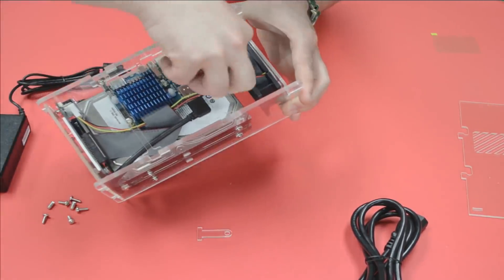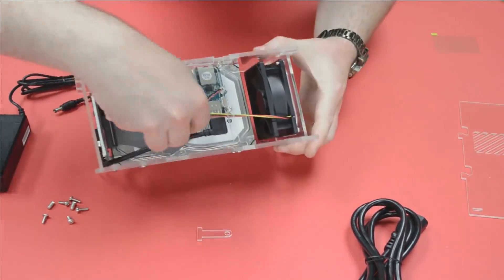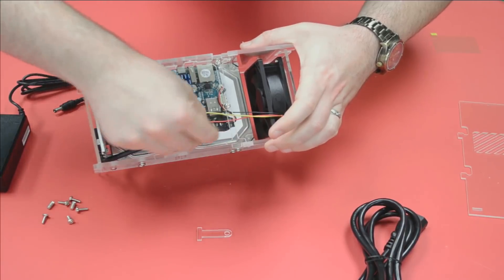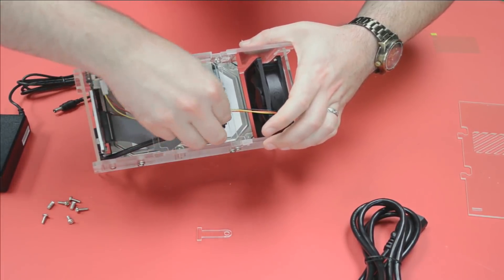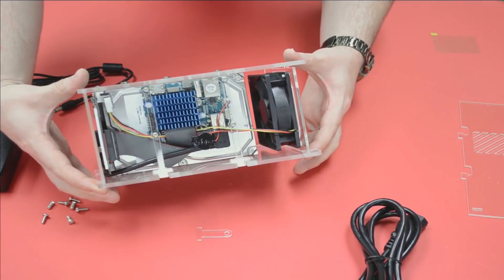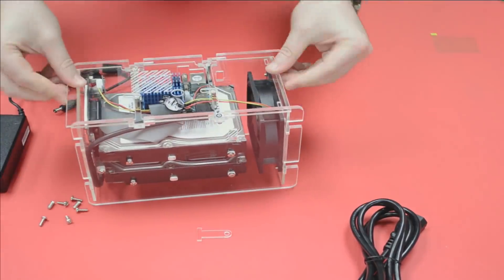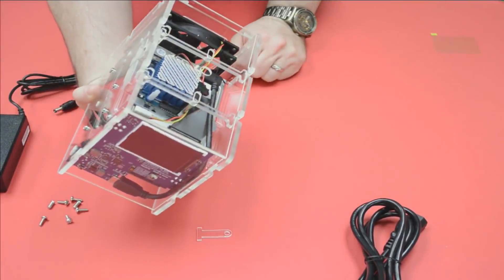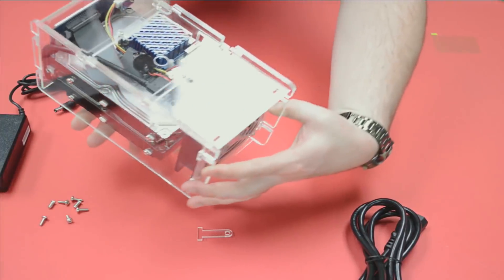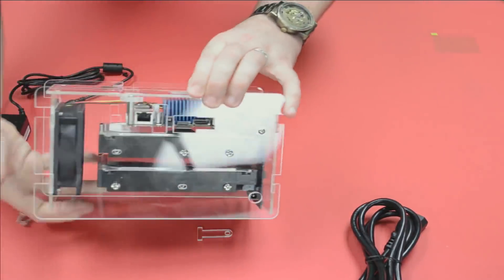I mentioned this battery — it's sold separately, but it means that if you unplug the power from the Odroid, it will remember the time and date. For the extra couple of dollars, it's worth getting the RTC — real-time clock — battery. That just pushes in and goes aside. And that's pretty much all there is to it. Slide the cover on — nothing is quite locked into place yet, but look at that: absolutely beautiful.